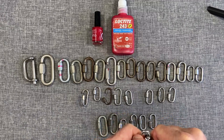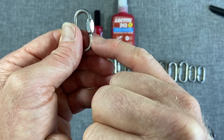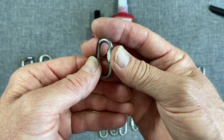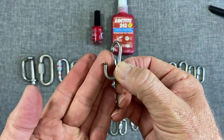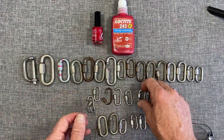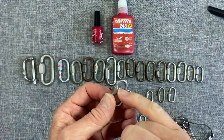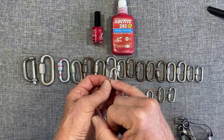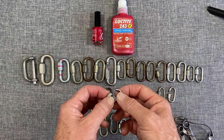Notice this one — when I tighten it up, there's very little thread exposed on the other side. If you notice how few threads there actually are on that side, you realize there's almost nothing holding. So from links being tightened up a bit too enthusiastically, the stop at the top causes the nut to break through and carry on going to the other side. It's tight as tight — then too tight becomes loose again.